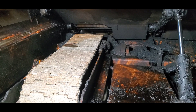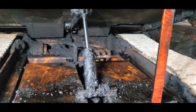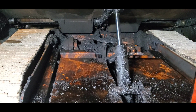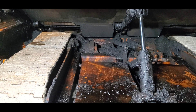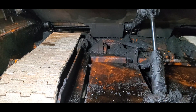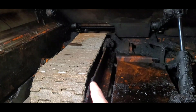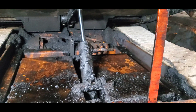The second thing I would change is how these tracks are designed. If you look at these tracks, they are exposed, and that is a problem. You can see all the old asphalt build up. We maintain this thing as best we can — it's a dinosaur and it's laid thousands and thousands of tons of asphalt. Asphalt can build up around the gears of the tracks and all these other locations, causing track issues.